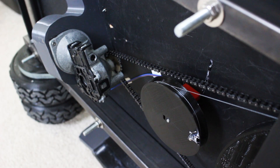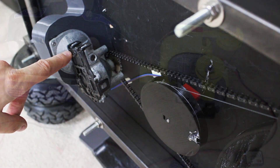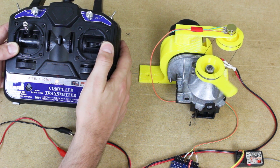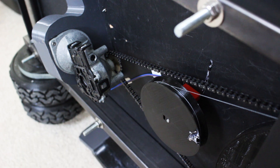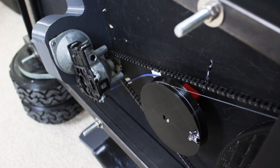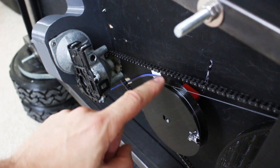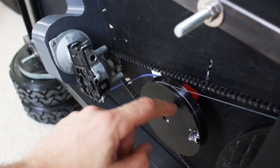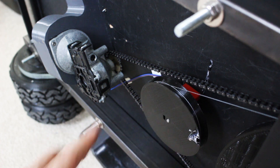The first thing I really need to do is fix the steering. We've got this chain drive from a wiper motor, and this works exactly the same way as the wiper motor big servo project I put up recently — that tells you how to use a wiper motor as a radio control servo. This chain is just driving the front steering. There is a feedback pot required so the servo can track its position, and at the moment that feedback pot is below the big pulley. There's a piece of string which goes around the front steering for feedback, but this hasn't been very reliable — sometimes the string falls off and I completely lose steering.